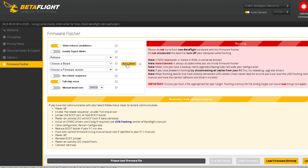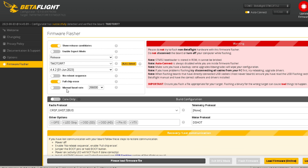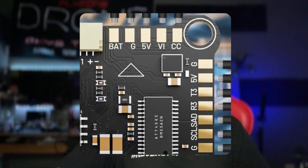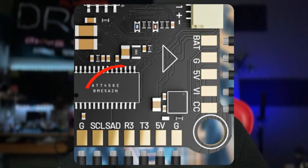By default, the flight controller comes with Betaflight version 4.3.1 and the target is T-Motor F7. For those who don't know, T-Motor is a well-established brushless motor company that makes some of the best motors in the FPV industry. This flight controller supports a BMP280 barometer, has a 16 megabyte blackbox flash, and it does have a BEC on board — a 5-volt 2-amp and a 10-volt 2-amp. There's an OSD chip, the AT7456E HD, and it weighs 5.2 grams.